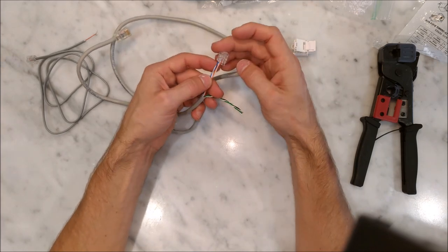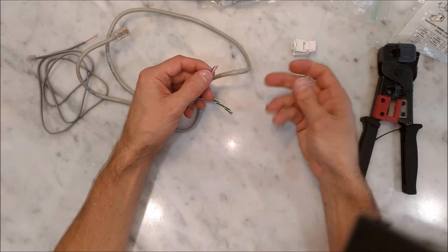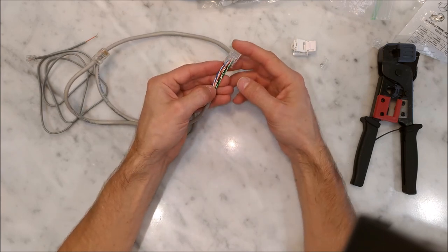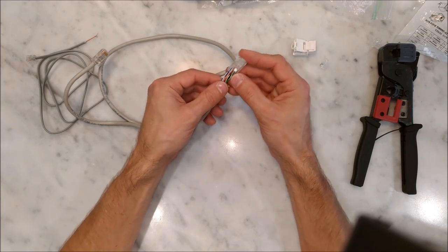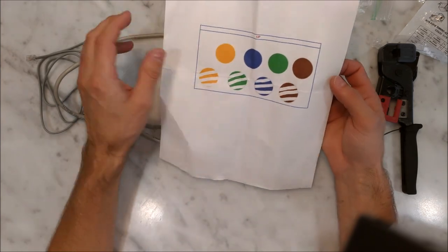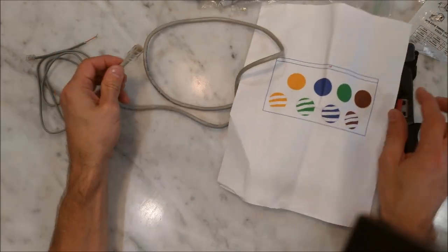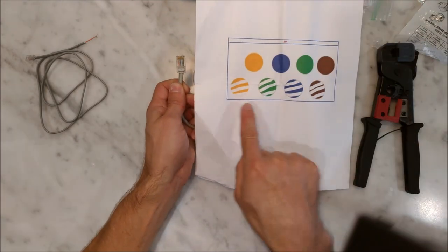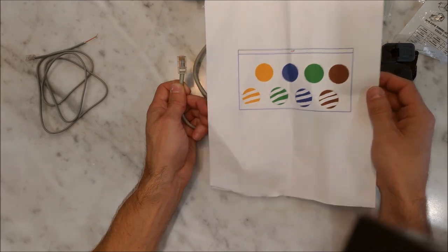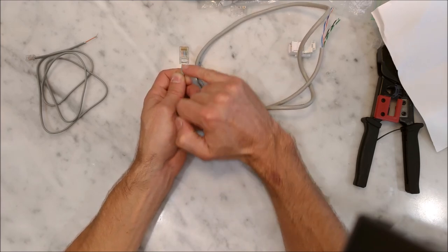You will likely have a telephone jack like this in your closet — that's an RJ11 plug. Cut that off, get some RJ45 plugs, and wire up the wires into the plug. There is a very specific order that the wires have to go in. I like to make myself cheat sheets so I know the order, but images are available online. There's a standard wiring code — the wires all go the same way. When it's done, it'll be in that color order. Cut off the telephone jack end, put on an RJ45 connection like this, and use all eight wires instead of just four.